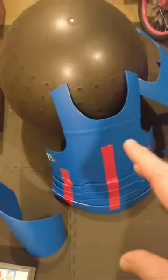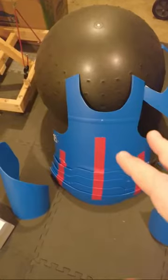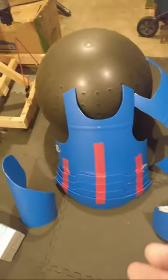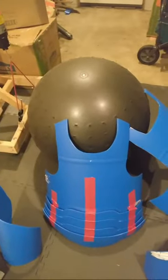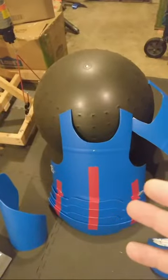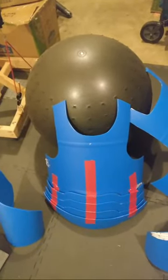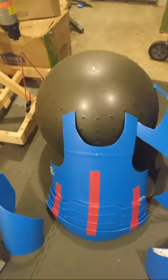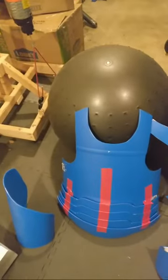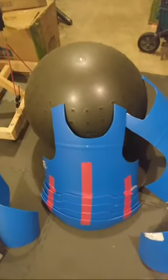How I got this far: I put painters tape on my body while wearing a heavy jacket to approximate my body plus gambeson — that padded armor component. Your armor system has a soft layer and then either chain mail or plate mail over that. When making plate armor you have to make sure you have enough space between your skin and the inside of your armor to fit your soft padded armor. So I wore a jacket, taped down the form with painters tape, made the form out of butcher paper, put it on the barrel, and cut it out with a jigsaw.